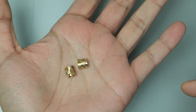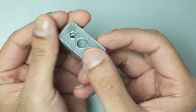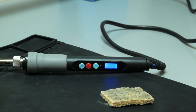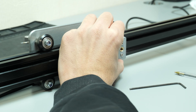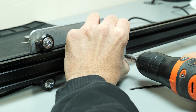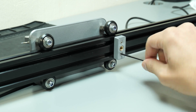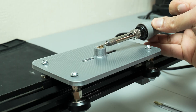I'm going to make use of these quarter inch inserts that I picked up as well. This is a 3D printed part that will go onto the aluminium extrusion using some T-nuts, and then one of the inserts here will be used to help me attach the extrusion onto my tripod. And then to attach my camera onto the slider, I'll be making use of this standard ball head joint that I picked up from Amazon. Using a couple of T-nuts, I screwed that part with the heated insert onto the underside of the extrusion.